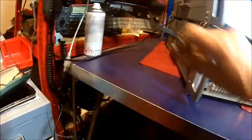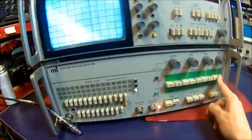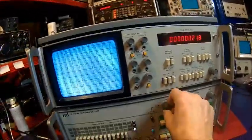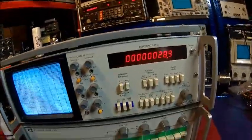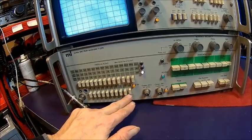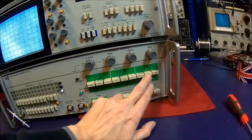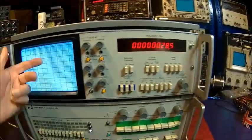We're at 10 MHz per division, center frequency. We should have the signal on the screen now. The problem is I can't clean it on the back side. Either we have a problem with the HF unit — let me check. If I take the thing out, we don't have a noise floor. I'm on maximum sensitivity and there is no noise floor.